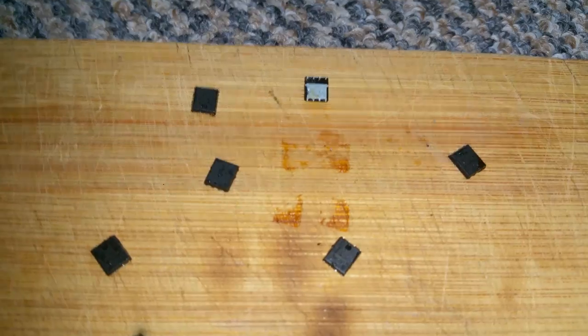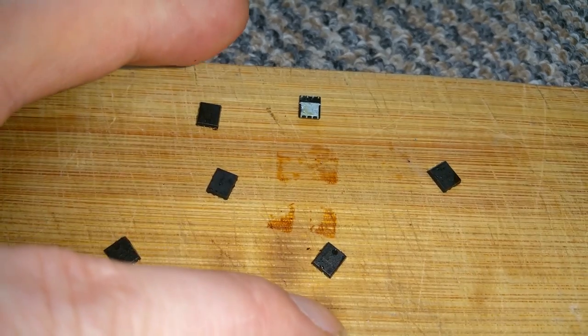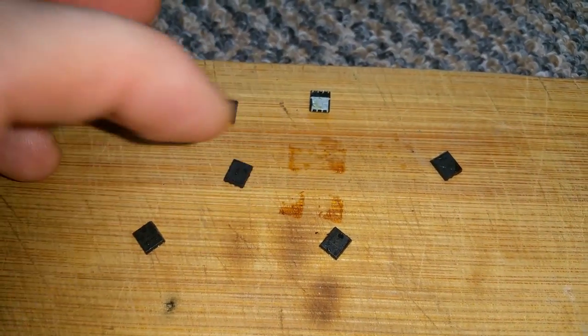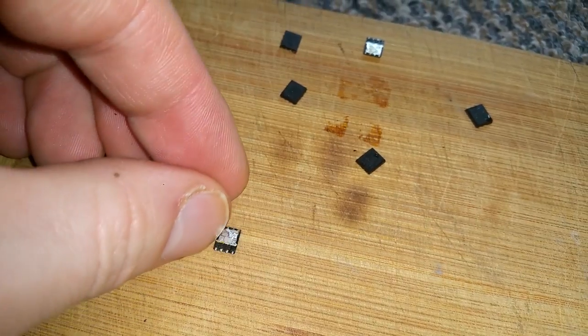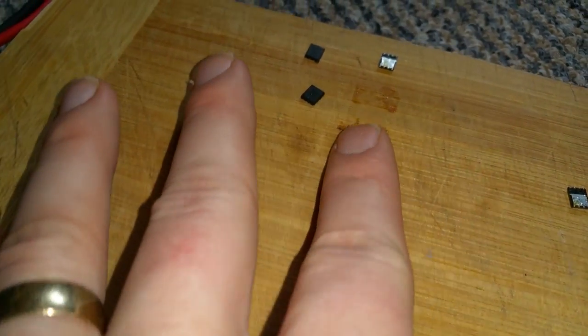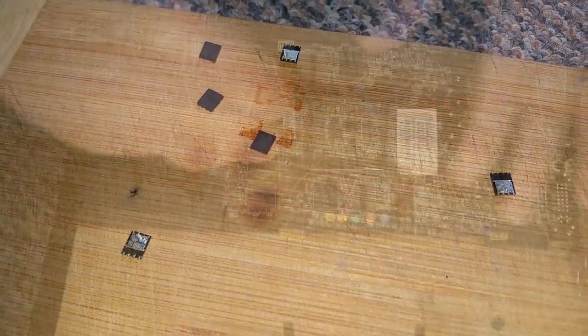I measured all six components one by one and found that this four is alright, but this one and this one actually got a short. I'll show you — there's a short between this three and ground on the middle; the last one is alright, but this one has a short between all four. That means I will try soldering back just these four and keep out these two, which are just support from each line. Hopefully the card will be working without them. I'll take off the cooler again.